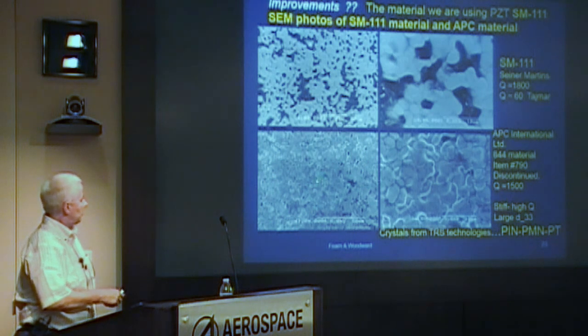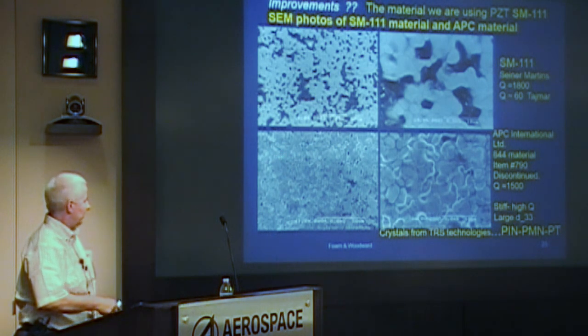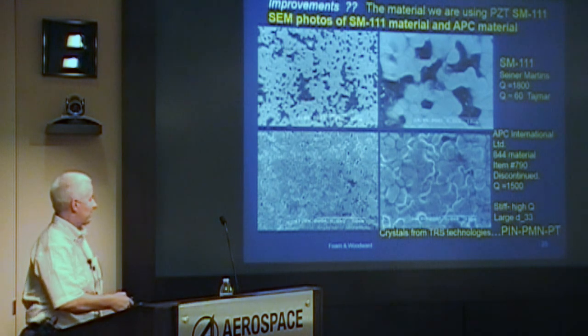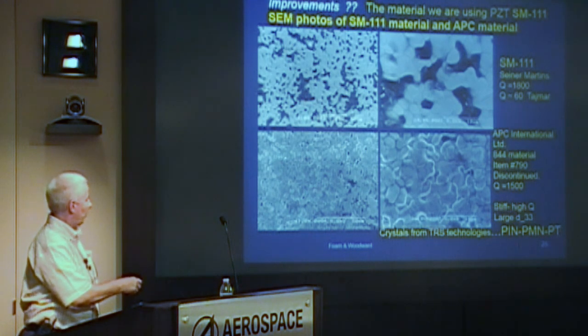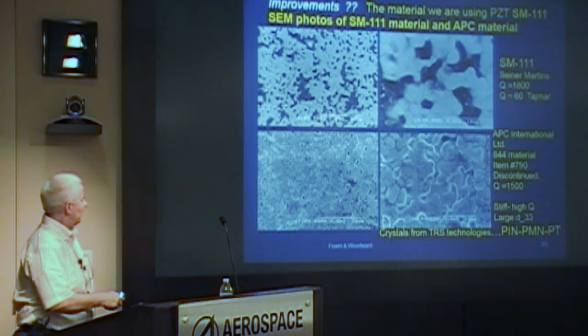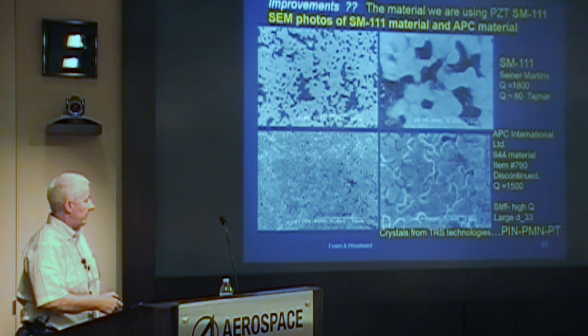So looking at between this and this, this one seemed to have the dark. There's a bit of discharge going on here, I think. I think I was slightly at too high a voltage. So I was at 8 kilovolts. I was probably overdoing it a little bit. And because it's a capacitor, basically the thing was charging up, and that's why it looks a bit glowy. So this one wasn't so glowy. This was also 8 kilovolts, though, but it didn't glow as much as this one did. So the material was glowing like crazy and discharging all over the place, but it didn't have so many holes. So we were thinking possibly this material might be a little better.